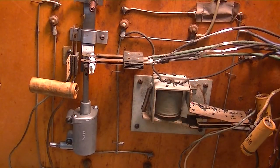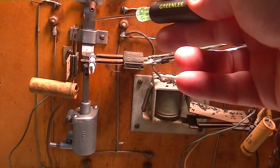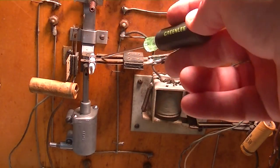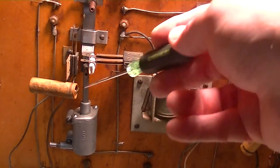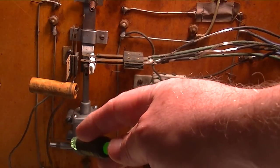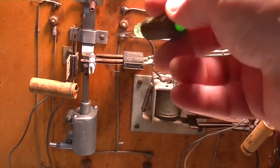This is that normally closed switch that's always in series with the R2 or R4 relay — one of them is 6-volt and one of them is 18-volt. It ties in with this switch here, which is the switch that resets the horses. So when you put your coin in and push the coin slot, it's going to close this switch. And when this switch closes, this opens. There's an air piston down here, kind of like the things on a screen door to slow it from slamming. What this does is it allows the switch to be made longer — if it's not timed correctly and the horses don't come all the way back, you can screw this in and it will let less air out, making it go slower or faster. It's adjustable. These switches open up whenever this is closed.